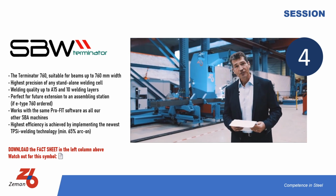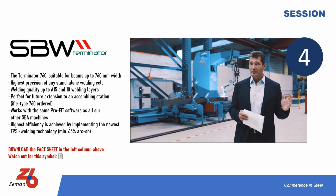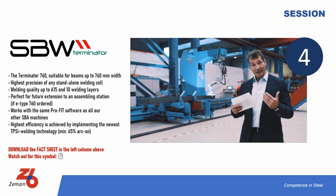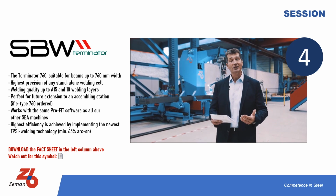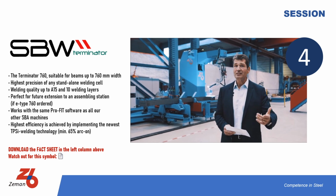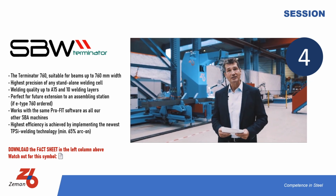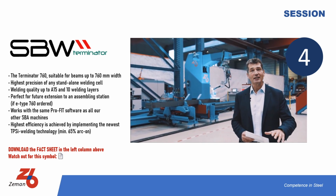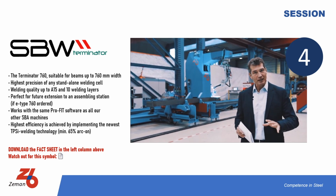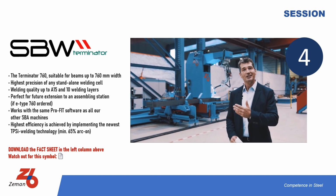Let me add finally one thing. If you order this machine at the very beginning with an open tunnel, similar to the SR Compact, that means the welding tower is open and it's already designed for a future extension into an SR Compact. So that means even the welding cell can be extended in the future to an assembly and welding line. So this gives you the highest flexibility. Start small, start with a welding cell, but in the future, extend it with a manipulation robot for picking up the part, add on tack welding and finish welding. Thank you very much. This was our Terminator 760.